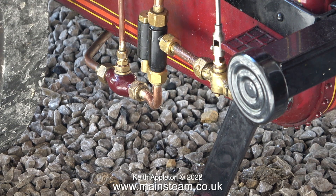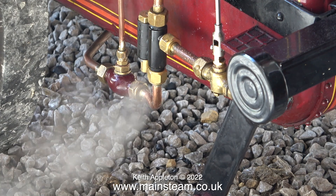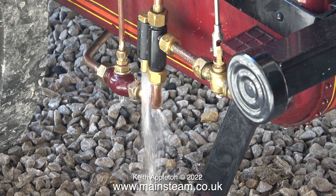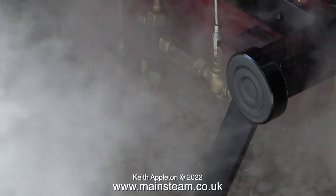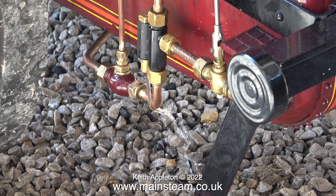When I filmed this sequence I'd removed the ball from the boiler check valve, but there's still one in the egg-shaped valve at the bottom. It's actually trying to inject at the moment. I ran the water to cool the injector, then opened the steam valve, and it really was trying. For a short while it dried up and did inject into the boiler, but not for long. I repeated the process and once again it's really trying — it's dribbling a bit, but it's not making the noise I want to hear.